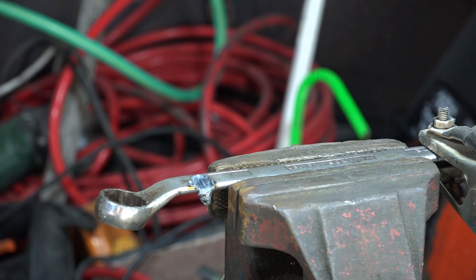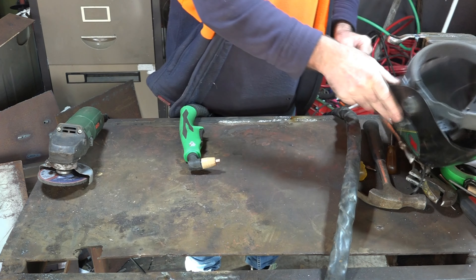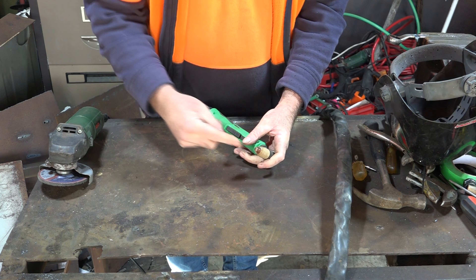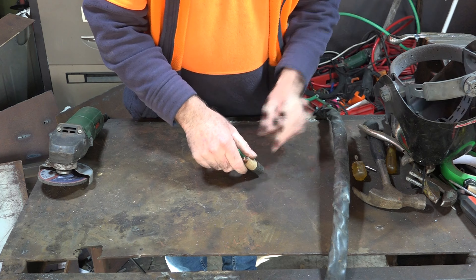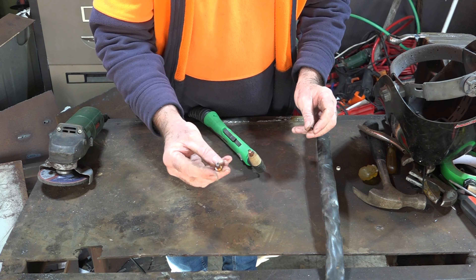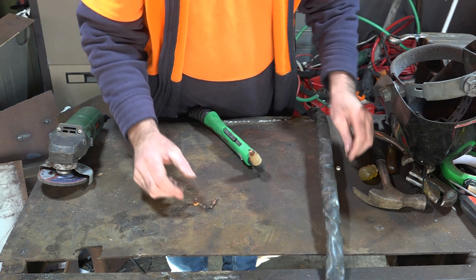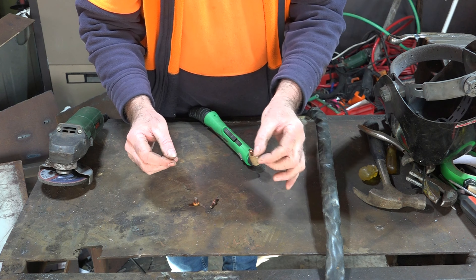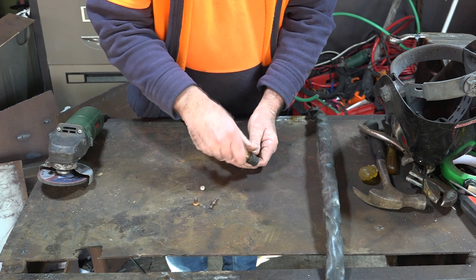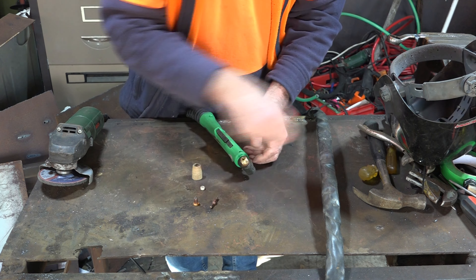So I've come up with a little modification guys. I'll show you how that works. What you need for this is just standard electrodes and tips, but I wouldn't use a good one. If you've got a buggered one lying around somewhere, grab that. I've got a buggered one here - see that, it's burned out. And I've also got a burned out electrode here, so we'll use them. You're going to need your original swirl ring as well. I don't recommend you do this - I'm just showing you what I do. So we'll take the good electrodes and tip out and we'll use that later.